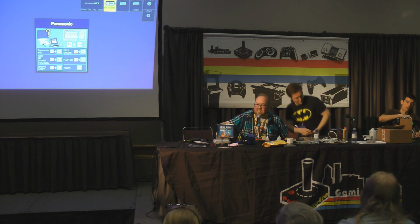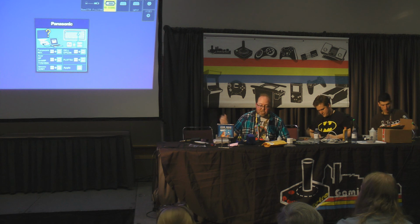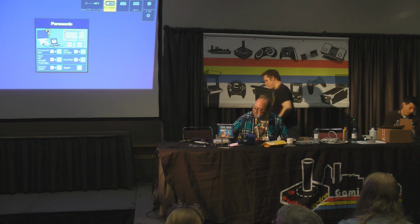Can y'all give us some guidelines or tips for when you first pop in a game, to differentiate whether it's worth saving? What can you notice right off the gate to say, if I see that, I'm pretty sure I can get it working again? It's probably just, like regular Nintendo games, the CHR and the PRG. So when I see the characters glitchy, it might just be the CHR ROM. But then when I hit start, it didn't actually play. So something like that might be a different chip in there. More complex games like Mario 3 have multiple chips in there.